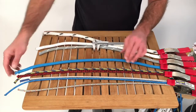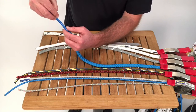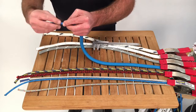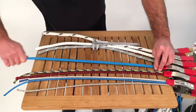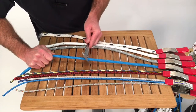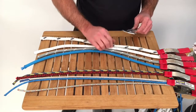7/16. This is a double braid, but it's a coated Spectra core, and the coatings on these usually kind of glue these cores down into a set orientation. So there's not much constructional bulk in that, but there is in the jacket, because the jackets sometimes slide like that and get real thick. So I'm going to make sure I've got this milked all the way down. And while under pressure, under load, wow, they really hit that one. I'm just making slight contact with the nubs of the cover. Very confident I've got 3/8.